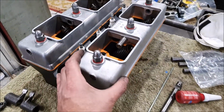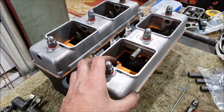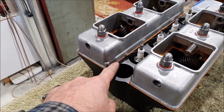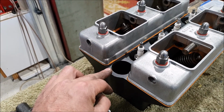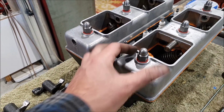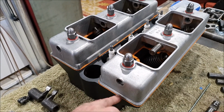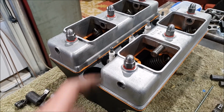Because of course the rocker boxes just lift off and the rocker gear is attached to them. It's not attached to the head. These gaskets apparently need to be nice and thin, so these are the proper spares gaskets. And that's so that when you bolt all of this up, one, it's oil tight, obviously, and two, you don't put too much strain on the little bridges inside there.